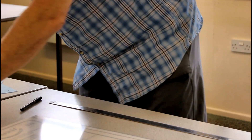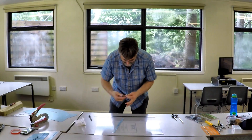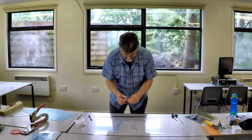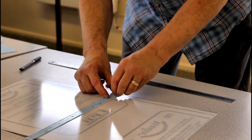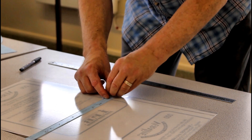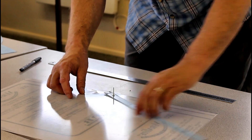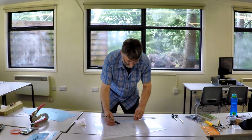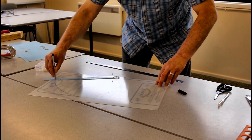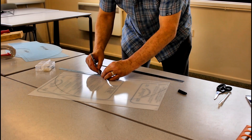There's our hole, and now we use a small nut and bolt to hold this in position. Once we've got it in position, we can now scribe out the line — just checking we've got it in the right position. And now an inner cone line.